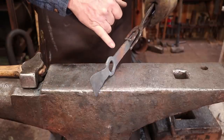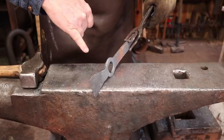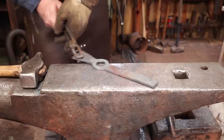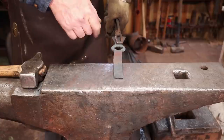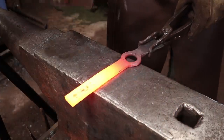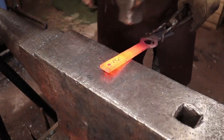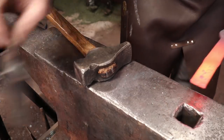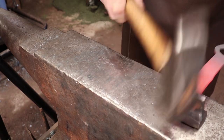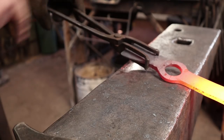That's going to bend back away from the little offset, and that's what helps the whole thing lay flat and look smooth when we're done. This will get a bend here going this way — a pretty gentle bend — and then we'll have another similar shoulder that bends the other way. I think I'm going to put the other shoulder up here. I think they both need to be on the same side. I'm going to start flaring it and then cut it so it's the same length as the other side. I need a bend there, a straight leg, somewhere up about here. I'm just kind of eyeballing this. These slotted jaw tongs really work well here. Ken's Custom Iron sells a slotted jaw tong blank, and no, he didn't pay me to say that.